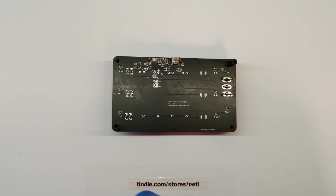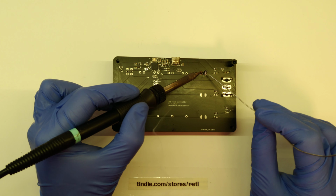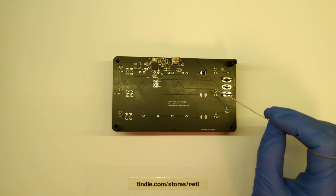First, I would recommend lead-free solder if you're selling stuff like me. For personal use, the leaded solder is a lot better. Just saying. So what we're seeing here now is that the lead-free solder tends to stick a bit badly to the solder joints if the temperature is not right. Let's clean the iron, take a look. That's probably not working out.